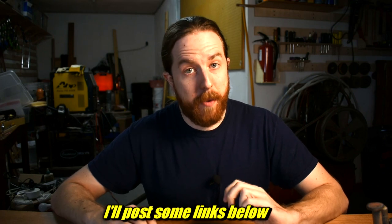Usually A356, from what I've found, is sold in massive, like 22 pound or 50 pound, super ingots. Just do the math and make sure you're not getting screwed, like dollars per pound. But aluminum is pretty cheap in general. And a pound of aluminum is a lot more aluminum than a pound of brass. And you're probably gonna make your money back if you consider the time wasted using the wrong aluminum.